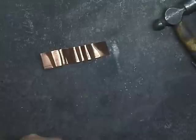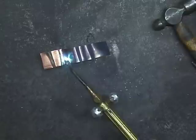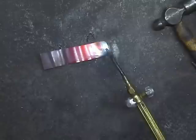But if I anneal it — and by annealing, it means heating this copper up until it's red hot. I'm using an oxygen acetylene torch. Keep moving my torch around so I don't stay in one spot too long, or I might burn a hole in this. Now that it's all red hot, I'll let it cool.